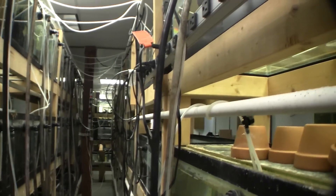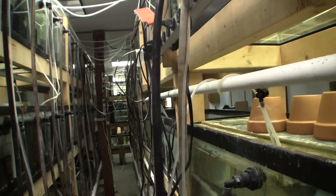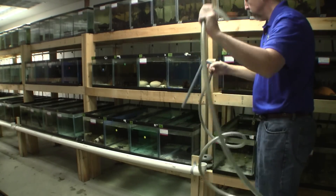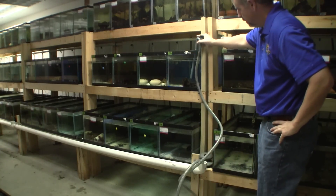When you design your water changer, you will probably want to hide all the pipes behind your racks, but make sure you still have access to all of them. These pipes at the bottom front of my racks drain into the same system as the automated water changer, and I use them to siphon water from the tanks for special maintenance tasks — the fewer buckets you need to carry, the better. My fish room still has a lot of buckets and hoses, and even with an automated water changer, I still spend about two to three hours every day on general maintenance, water changes, and solving problems. But it is the water changer that gives me the time to do that. If it were not for that system, I would not be able to manage this fish room by myself.